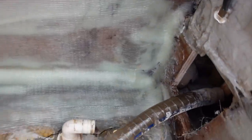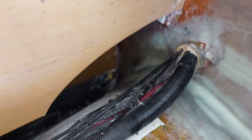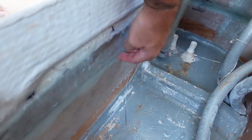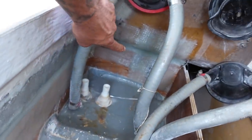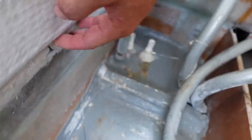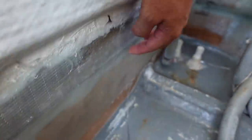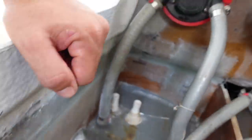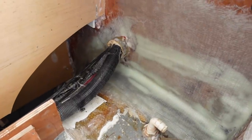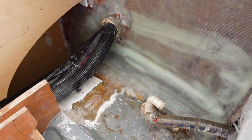All glass, tabbed and reinforced, right back to here — all of that goes down about 600mm, just over half a metre back there, and then up the wall. This locker here was just glue holding it together — that's the hull, this is obviously the deck — but we've glassed it together this time, so that's going nowhere. I don't think anyone can say this is not a good and strong repair.